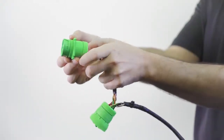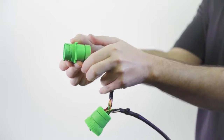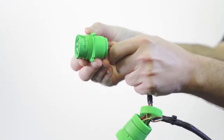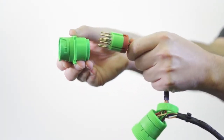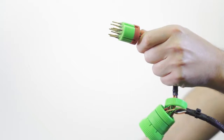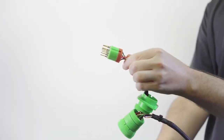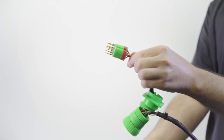To change the mounting adapter, unscrew the screw cap from the back of the connector and slide it out of the way. Grip the wires at the back of the cartridge and remove the connector and adapter together. Slide the correct adapter over the end of the cartridge, keeping the square notch pointing towards the pins on the cartridge.